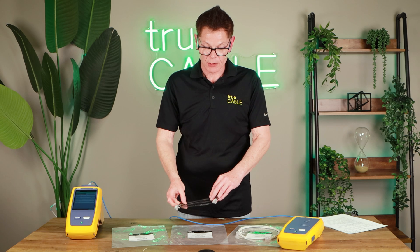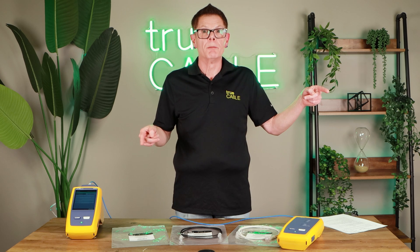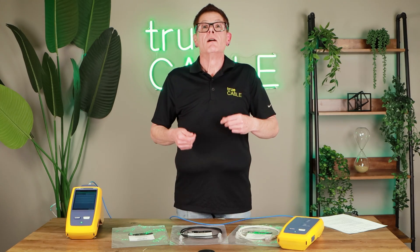As far as speed is concerned, you're going to get 10 gigabit if you use just the patch cord itself — from one piece of powered equipment to another, up to 25 feet with our patch cords — as long as each piece of equipment supports 10 gigabit networking. Speeds will drop to 5 gigabit when you start plugging them into full-length Cat 6 channels, where you have a permanent link and are using two patch cords, but that's what you'd expect with Cat 6 anyway. Patch cord alone: guaranteed 10 gigabit, no problem.